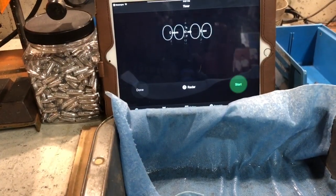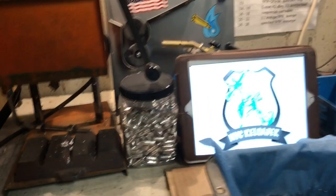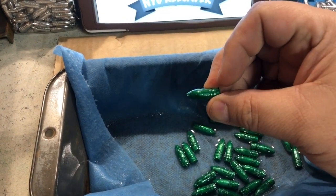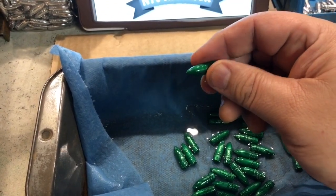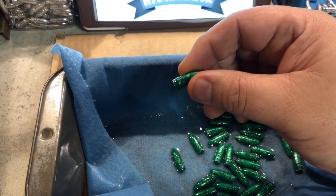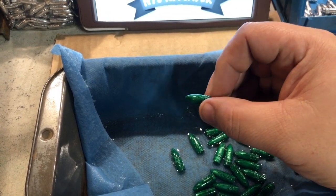Looks like we're coming up on our timer. I'm getting a second glove because it's very hot. I'm taking them out and going ahead and quenching them in water. You can see they're gorgeous. Happy to shoot those, I've got to tell you. Now all I have to do is dry them off and gas check them. Pretty darn good — filled out perfectly, both lube grooves are nice and even. I'll QC these as well and any that are not perfect will get thrown back into the casting pot. When I heat them back up it'll burn off the plastic coating with a little smoke — I'll have the fan on.